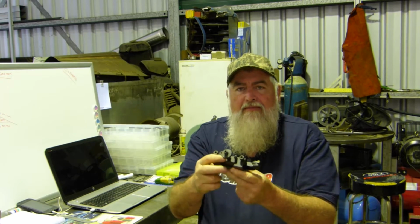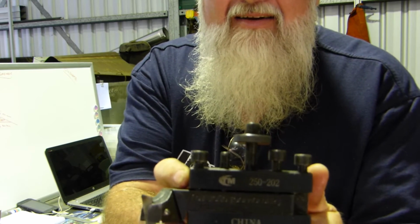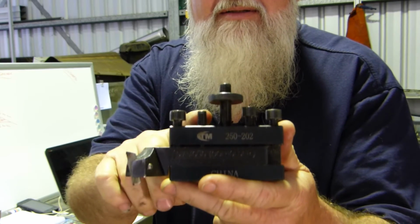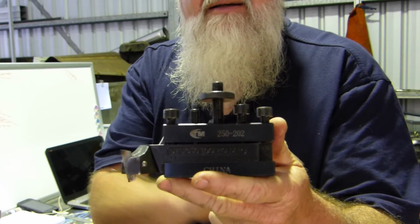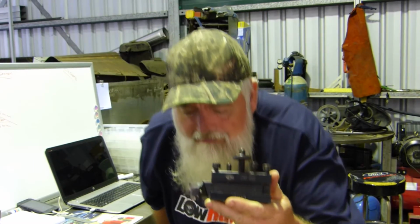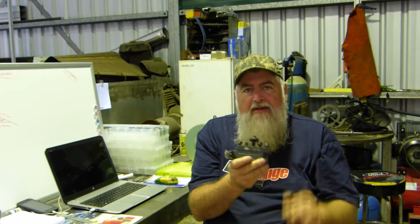And actually, another thing on the quick change tool post. I know they're only Chinese, but these screws here, they're just rubbish. I think I was probably tightening things up a little bit too far, but the hex plays up with them. So anyway, I've put some bigger socket head cap screws in there, but I do have some new screws coming. We've got some stainless screws I actually had access to, so I've got them coming.